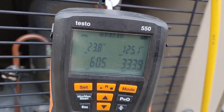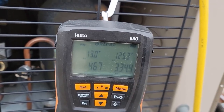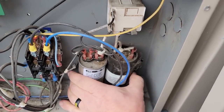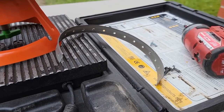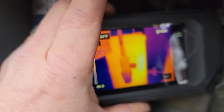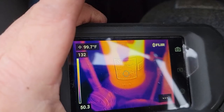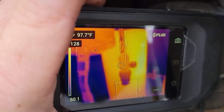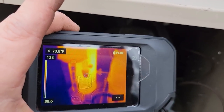See what our head pressure does. I might have overcharged a little bit — it sure is seeming that way. See how the head pressure is going up? Normally it'll go down, and it shouldn't be that high especially as cold as it is out here today. I did notice the wire tie they use, which is pretty generic — it tends to break, and it was broke, so I'm going to go ahead and get these strapped with some strap. I went ahead and heated it up. You can kind of see that area right there is where it was the brightest. It's kind of distributed out across the receiver now — it's definitely full, probably somewhere around that 80 mark.